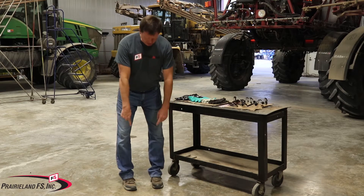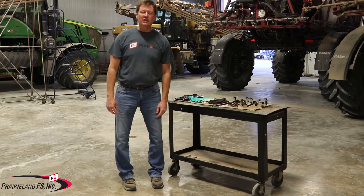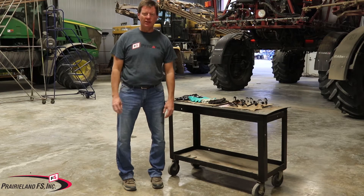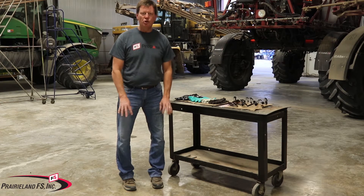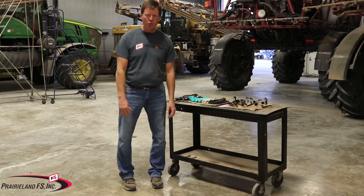I'm going to start with me, start down on our feet. You don't want to wear tennis shoes — they're too porous, they'll let anhydrous get to it. So you want a heavy leather or rubber type shoe, something heavier, not a porous tennis shoe.